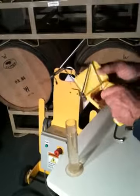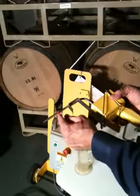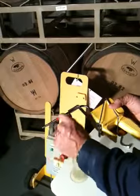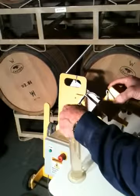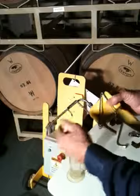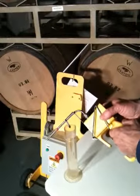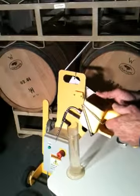It's very, very simple. All this band is used for is to indicate what level you have it calibrated to. If you want to calibrate it 1 inch from the tip, you slide the band to 1 inch down, recalibrate it to that level, it's a done deal. If you want to raise it up 1 inch, slide it up 1 inch, recalibrate to that level. No problem. Okay, so let's do a leak test.